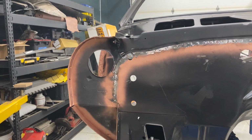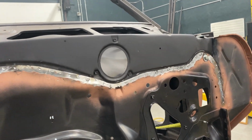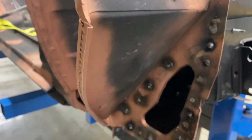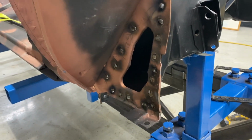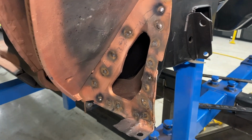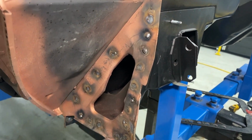Okay, look at that. Like a machine did it. So plug welds went pretty good. Then I put a number of plug welds down through here, and then the foot one down there. Now, on some of these, I didn't have holes pre-punched or busted the original welds out.